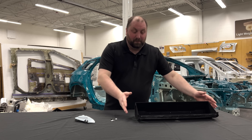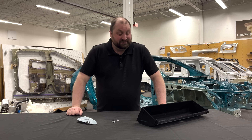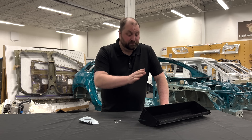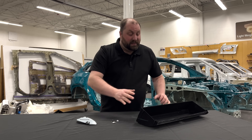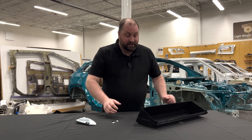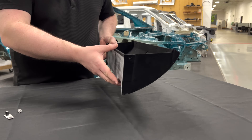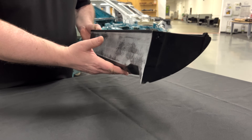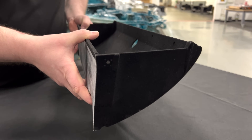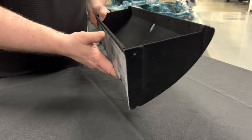So we are going to talk about Bob. Bob is the expert for injection molding. This is 1959–1960, and injection molded plastics are still very, very new. Bob is the expert and they have designed guidelines for how an injection molded part would have to be designed. This is the inside of his glove box. There is a hinge plane at the bottom, and Bob knows that when this door opens and closes he wants his pin as high up as he can, because that will be the best spot for durability for when the glove box needs to stop.